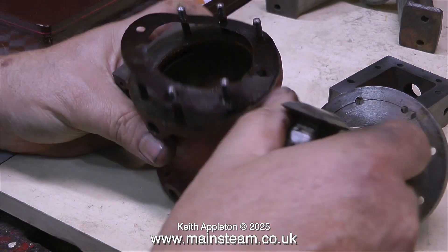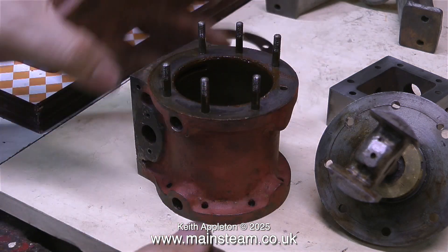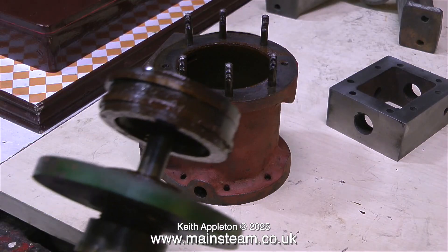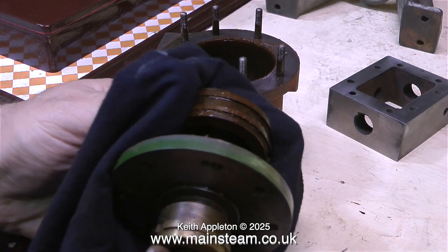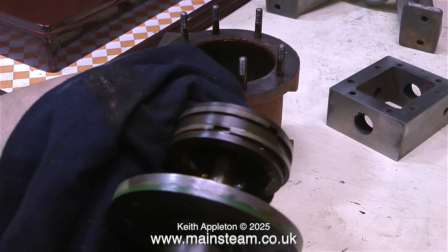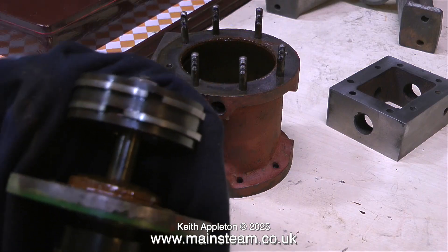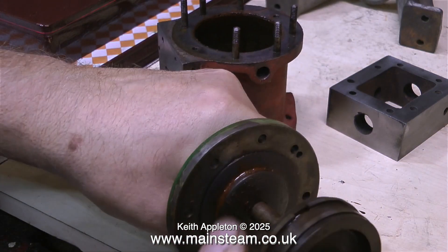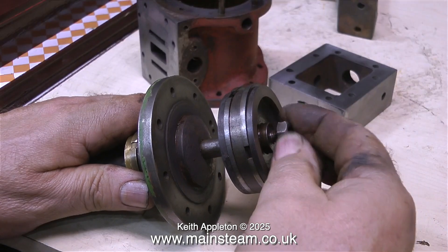It's time now to have a look at the piston. Originally it was quite difficult to separate the lower cylinder cover from the main casting, but after a few gentle taps with my soft hammer it gave way, and here it is out of the cylinder — the piston, a bit grimy but nice and oily, which is what I like to see. All the way through doing this I'm expecting the worst, as from my experience of working on such old engines there are usually lots of problems. But this is the exception to the rule — whoever made this really knew what they were doing.